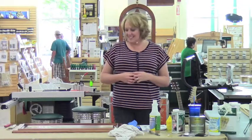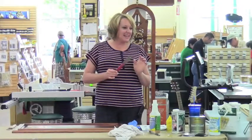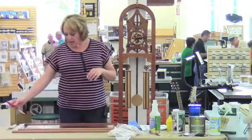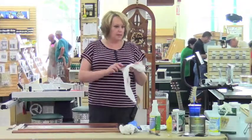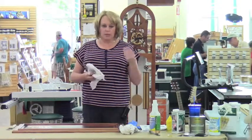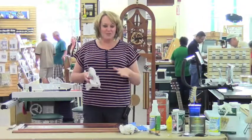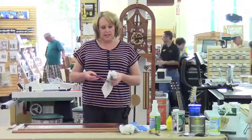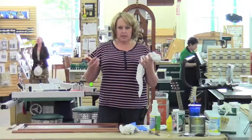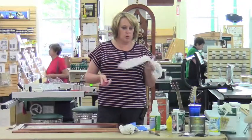This cabinet isn't bubbling up yet — which figures. Any kind of scraper or putty knife works. When it does start to do its work, you just gently scrape it off so you don't mar the wood, then use a rag to wipe off the product. It is water soluble, so it's not critical that you're completely covered. The product is really goopy — think of wood glue: thick and sticky. When you scrape it off, put it onto an old rag or something you can throw away. Old t-shirts are great for that.